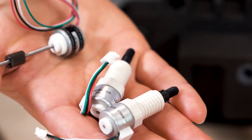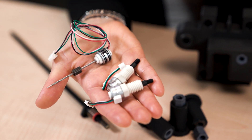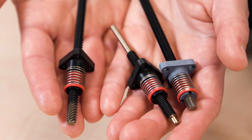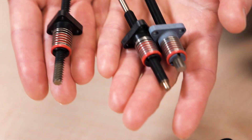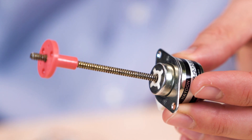In a lot of cases, these actuators are built around small stepper motors. Polymer nuts excel here because they complement the actuator's lightweight and small footprint, plus employ lubricious materials that reduce friction between the nut and the lead screw shaft that it rides against.